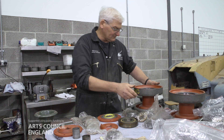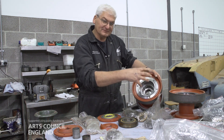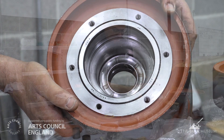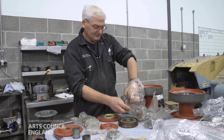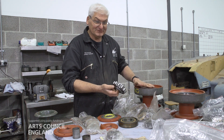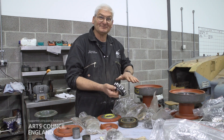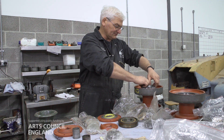If I just manoeuvre that wheel slightly - that is the new outer race already pressed into the wheel, put on with a bit of bearing fit. This component has the original spacer. Out of that wheel, out of that position, it's all been kept together very carefully so we put the same components back in the same place in the same wheel. That drops into the outside like so.